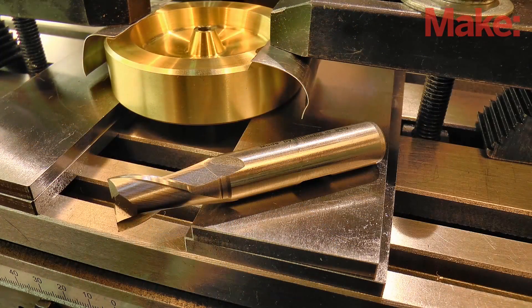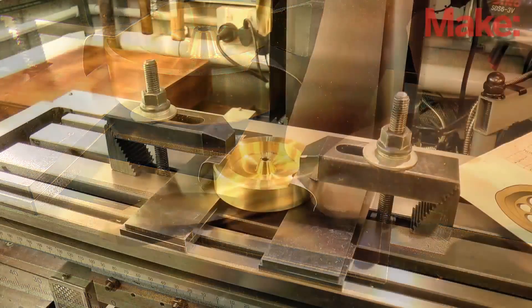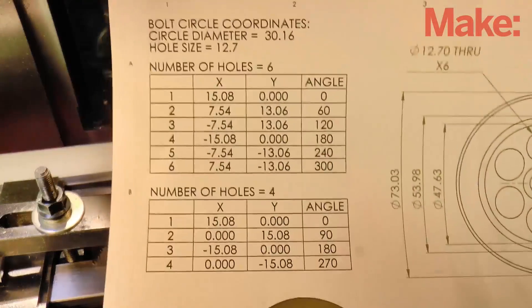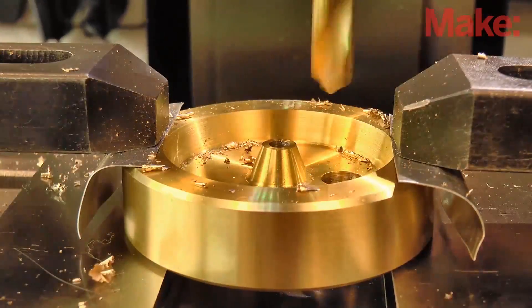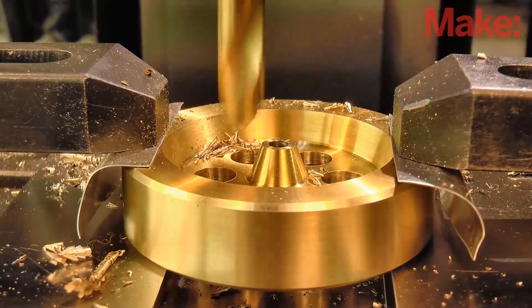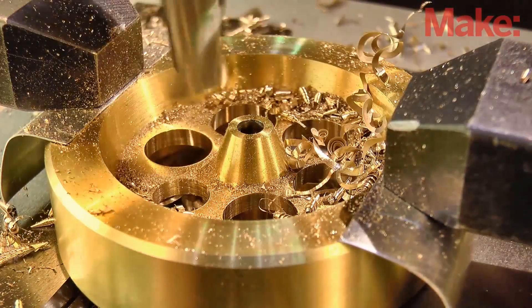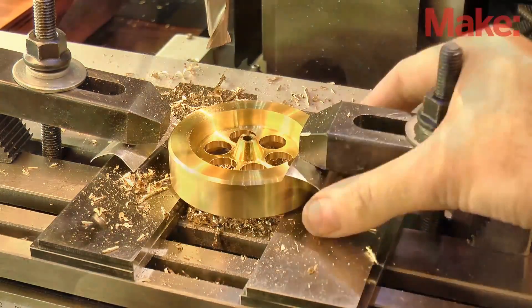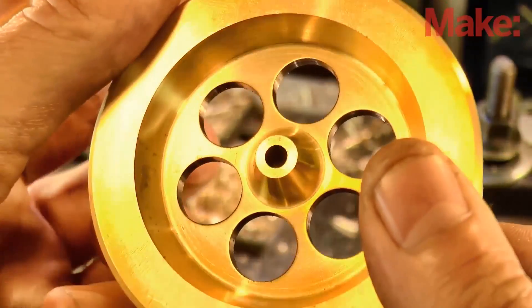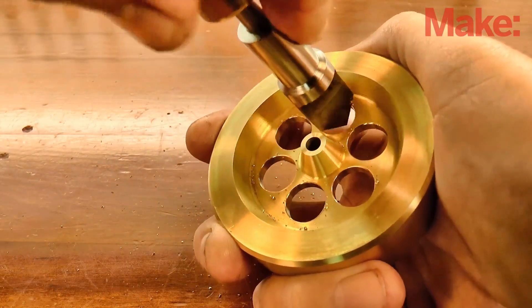I'm going to use this end mill for the final hole size, but since the metal is not very thick where we're cutting, I'm using a spotting drill to remove most of the metal first. And I've got the coordinates nearby to help me avoid making any mistakes. A 4 hole pattern is certainly the easiest to make, but if you're comfortable dealing with the handwheel backlash or you have a digital readout, then I think the 6 hole pattern is the way to go. The end mill will push up a small burr on the outside of the holes, so use a countersink or a deburring tool to knock those off.